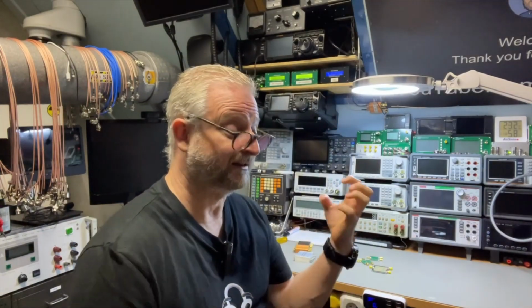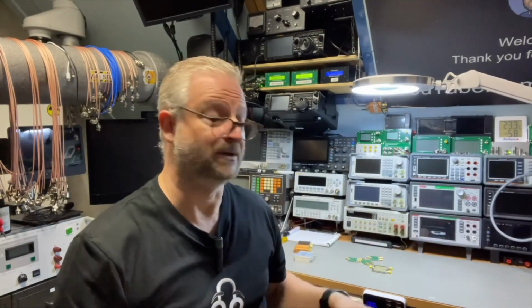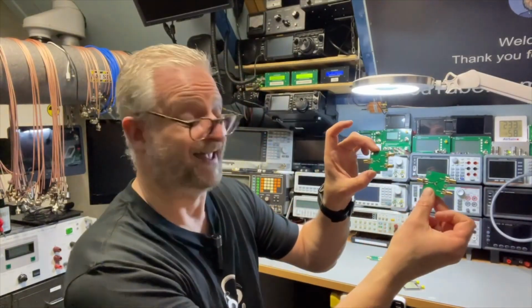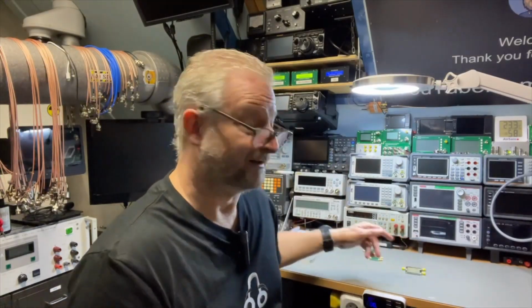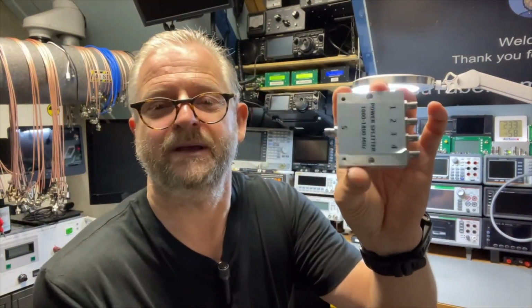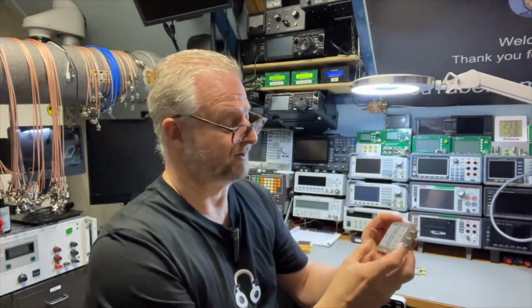The resistive one is not the one I want to use, because the satellite signal is so weak. They even need to amplify the antenna to get rid of the losses in this 5-meter cable. Cable loss is usually really below 10 dB, no, 1, 2 dB, maybe a connector, maybe half a dB. So if I'm going from 1 to 4 channels and I'm already losing that 12 dB, that would be too much. Then I have no signal left after I've split it. So then I will probably come into something like this special frequency range with all this magic RF stuff.